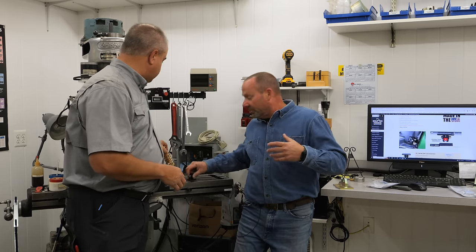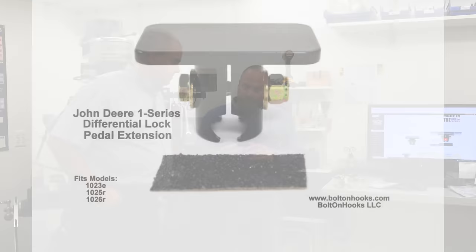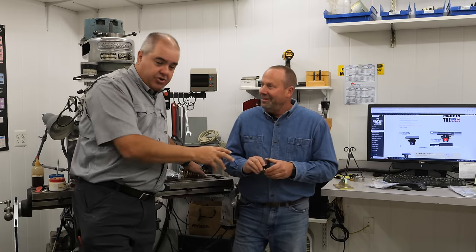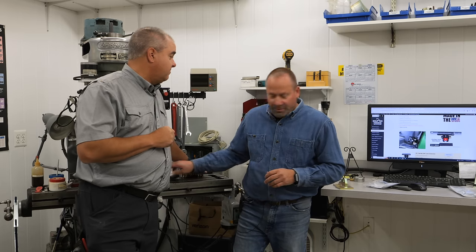The original dip pedal — we were the first to market these; it was the second product we ever showed. These are all laser-cut parts, 3D laser-cut on the tube laser, welded together, powder coated, all solid steel. There are guys selling plastic ones or 3D-printed ones, and those probably work pretty well, but this one can handle the stomping — you're searching for it with your foot and can't see the pedal. I'm still using the same one that Ken sent me eight years ago.